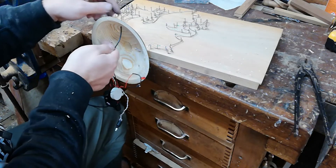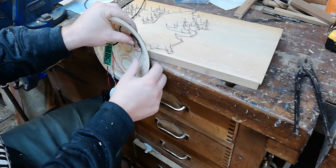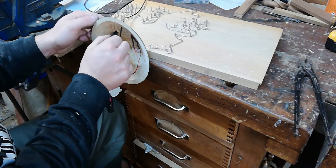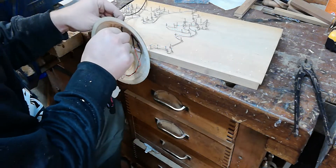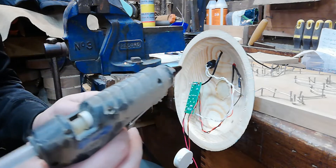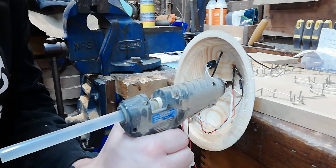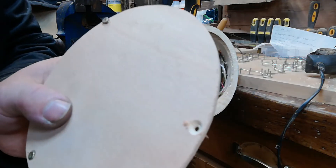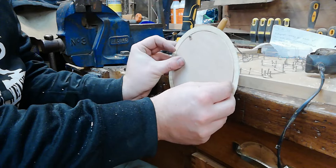After soldering the wire, we thread it through the 6 mm hole, then put the LED through the 5.5 mm hole — braiding the wires together makes a neater job. The switch goes through its hole with the top removed to fit; a spring washer and nut go on from the other side. To neaten up wires and stop components falling out we use hot melt glue — a blob over the LED holds it securely. Be careful not to touch the glue with your hands or you'll burn yourself. Finally, drill three countersunk holes and drive tiny self-tapping screws to fix the PCB in place.